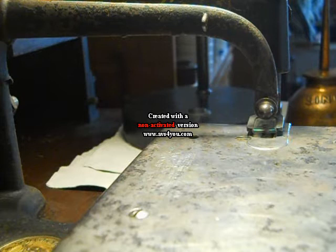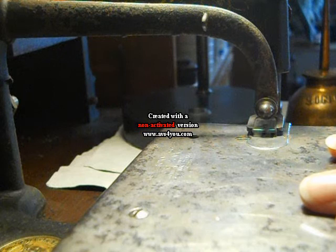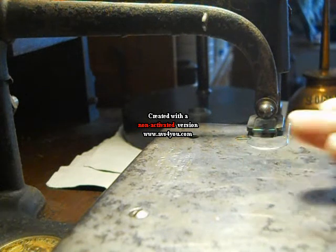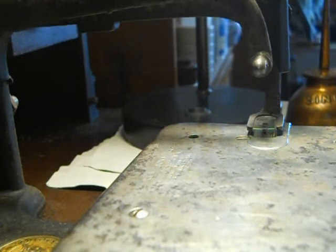I did try it a moment ago, and Miller from the Treadle On Wheeler and Wilson Yahoo group has said the belt should have one-eighth of an inch clearance. I think the belt I'm using is just a little bit wide in a couple of places, and when I have the cloth plate off, the machine goes fine. Now that I've got the cloth plate back on, the belt — being thick in a couple of places — seems to get a little stuck, so I may have to figure out a way to shave some off the belt. But I'm going to try and see if I can get it to treadle.